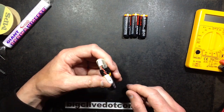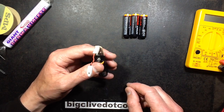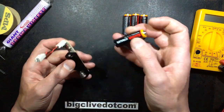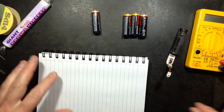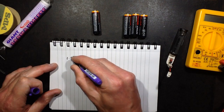The best thing is that it will run right down to about 0.35 volts once it's running — I'll cover that later and show you why it does that — but it means that a dead battery can last a long time. If you consider that a typical alkaline cell starts off at 1.5 volts, and if that's 0 volts at the beginning of its life, it starts at 1.5 and goes fairly progressively down over time as you discharge it.